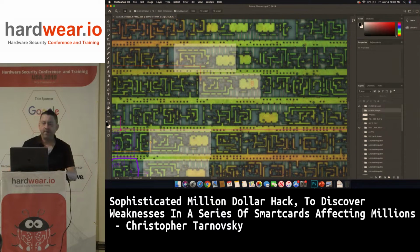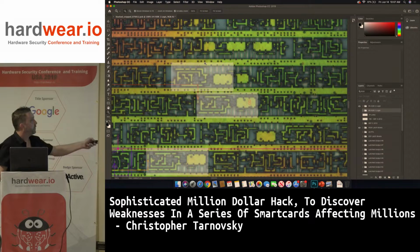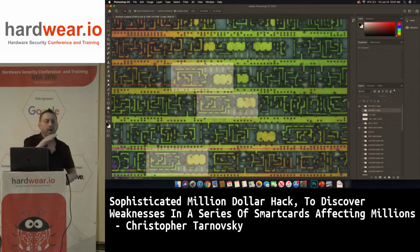So you can see ST put down metal sometimes. I don't know why. Like these plates, this is nothing. This is just sputtered metal. It doesn't do anything. In fact, if anything, it helps me with my polishing. Because when I polish, if there's an open gap here, sometimes I'll get a hole, like Chris Gerlinski talked about yesterday with wet chemicals. You'll get a hole in the oxide deeper than everywhere else.